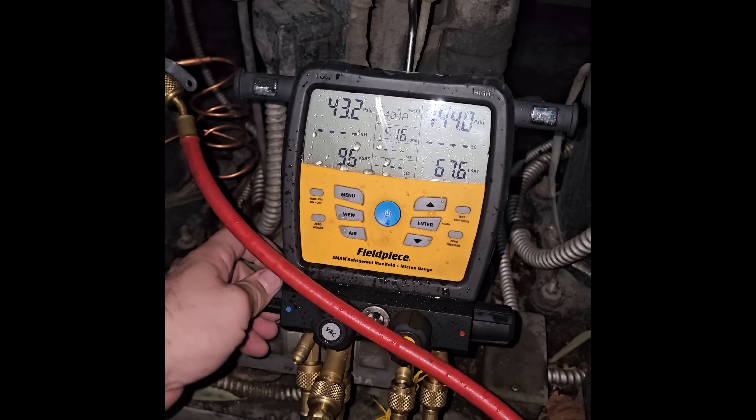This other compressor over here — the one where the defrost clock was stuck — looks like we might have a flooding TXV too, because the whole compressor is just frosty, but this guy just turned on. It's still bringing the box down to 10, running in the forties, so we're going to wait for it to satisfy and see if the TXV calms down. This guy also has a leaking receiver that we're in the process of quoting. We were checking TDs across the coils and two of the TXVs don't seem like they're giving great TDs, but we're also flooding. If it's coming down to temp we'll leave it — that's a problem for another day.